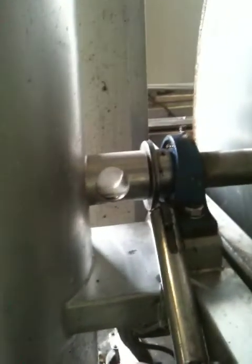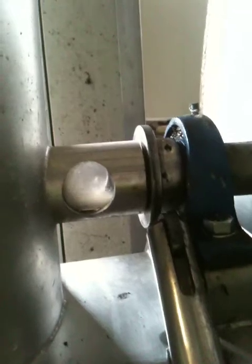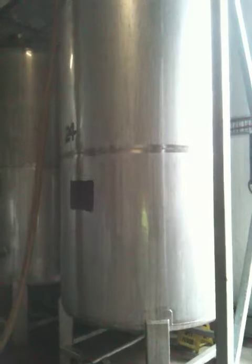If you have a look here, you can see just in that little side glass a little bit of wine getting sucked through. And it goes into this big receiver cylinder, where the vacuum's also getting drawn through. And when it hits a sensor, the pump will turn on and it'll go out through here, through that hose, and up into this tank. And it'll be nice, clean wine.